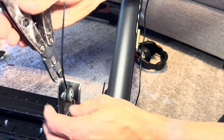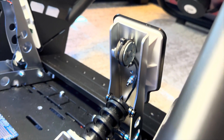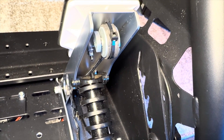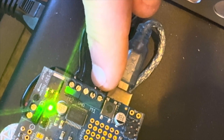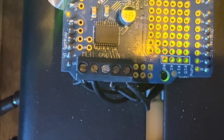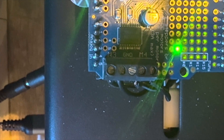Pretty much phase one physical install was done. Here's what it looked like once I got the wiring in and fed it into the Arduino Uno — there's the accelerator, there's the backside of the brake in action. I had to wire it to the Arduino Uno and the motor shield. You can see M1 and M2 on that motor shield go to the fans of my wind simulation, and the rumble pedals are wired to M3 and M4 — brake to M3, accelerator to M4.